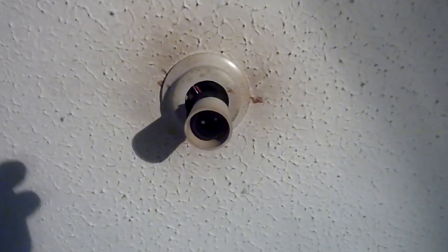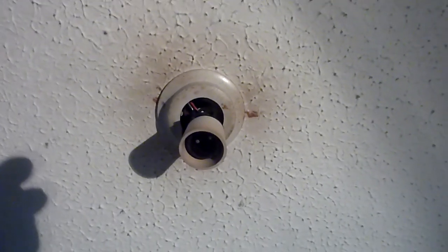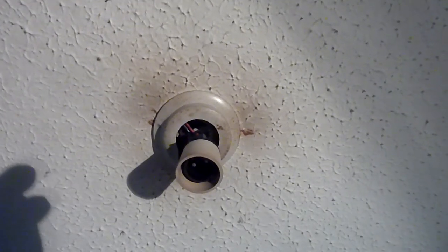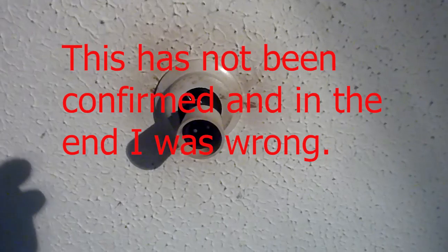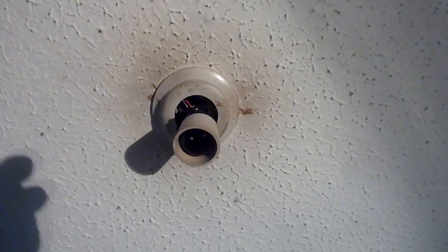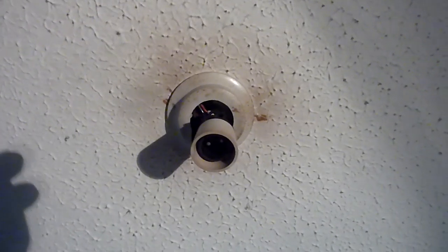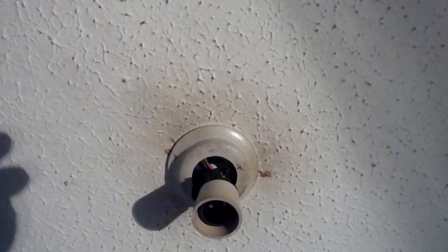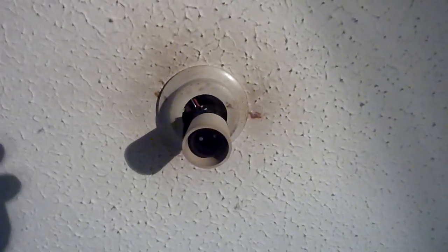If that's not the case, like I know it's not the case in this one, because years ago mice got above the ceiling of this house and bit through the cable, and it's been okay for years, but now it's gone to a state where there's a short in it. When the switch is switched on outside the wall, if this is the bathroom area, there's a loud crack, pop, and you might even be able to see a flash above it where it trips because there's a short circuit.